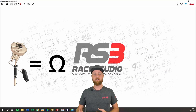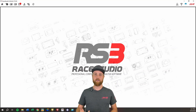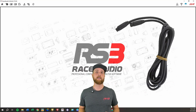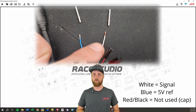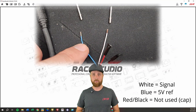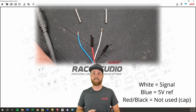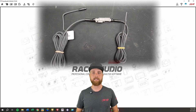Most fuel senders read in a resistance value. We need to convert that into a voltage in order to add it to one of our analog channels. To start, we're going to do hardware first. The easiest thing to do is to take one of our channel patch cables, cut the sensor end off, and that'll give you access to the wires inside. You'll find a white signal wire — that's going to go to the signal wire on your fuel sender. You'll also find a blue 5-volt reference wire, which is going to be connected to the signal wire using a 2700-ohm resistor. You'll also find black and red wires — those don't get used in this instance, so just cap them. For this example I used DTM connectors, but there are a number of ways you can do this as long as the circuit gets set up in the same way.